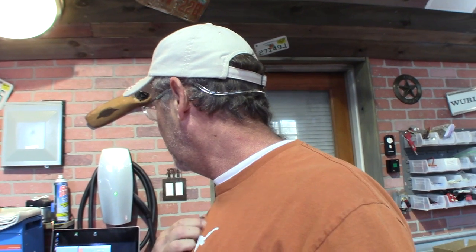I can't tell you. I can tell you what I think it's going to do, but I can't tell you what it actually does. Right now, the Leaf batteries will run one air conditioner for 8.5 to 9 hours. The main salon, it will run all 3 ACs for right at 3.5 to 4 hours. You know, this is all temperature dependent. The temperature goes up, obviously the ACs run more, so the compressors cycle more often during an hour. I can run 2 ACs, the main salon, and like one of the hulls for right around 5.5 to 6 hours. Well, I'd like to double all that. And I think with the Tesla batteries, we're able to do that.